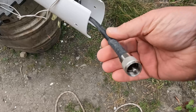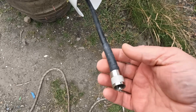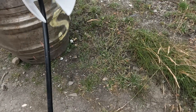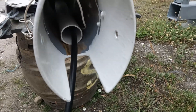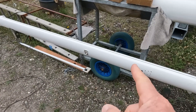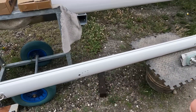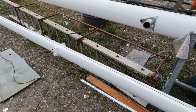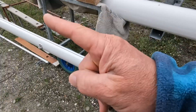We've got a pre-made 10 meter cable from Digital Yacht, which hopefully means the connectors are really reliable, but they are large to get through things. What I have fitted — you can just see at the bottom there — is a 34 millimeter cheap plastic plumbing pipe, three sections of it through the mast at each joint. I've simply tied them together and covered it with gaffer tape and then with the mast this way up so the pipe is resting on the bottom, held down by gravity. I then riveted it along all the way.